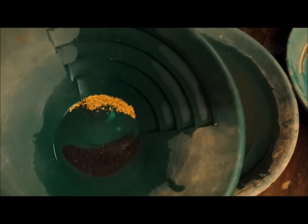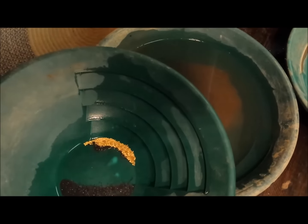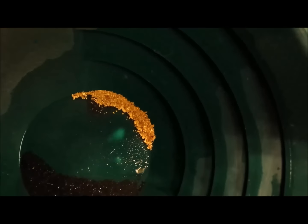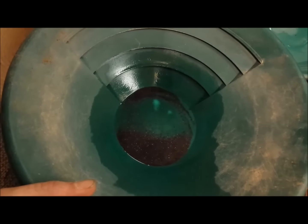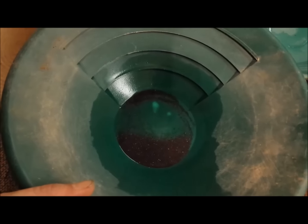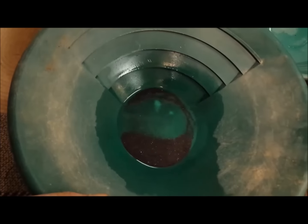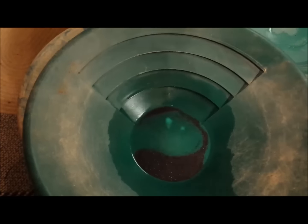We'll do a good clean out and go back through that non-magnetic black sand. Here's the first about 2 tablespoons of the minus 50. I haven't classified to 100 — I just wanted to do a test one real quick to see if I need to go down that far. Based on this one, I don't think I need to go to 100. I'm not going to show you every 2 tablespoons; I'm doing them 2 at a time. Once I finish all the minus 50, I'll show you a total of that.